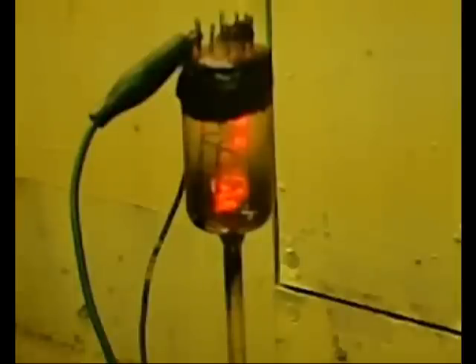I'm going to go ahead and leave it and close the valve off. I'm going to cut the voltage — that's 200 volts, 150, and it goes out at about 125 volts. Taking it back up, there's 200. We cannot fire the tube with 300 volts. So the initial firing voltage with just pure neon is a little bit high. I'm going to go ahead and leave it at that and seal the tube off, and we'll just use a higher voltage power supply to test it.